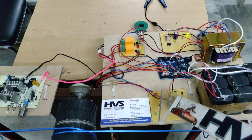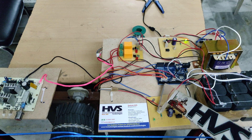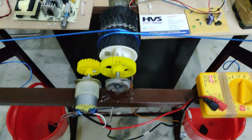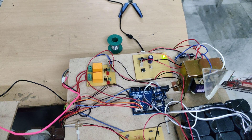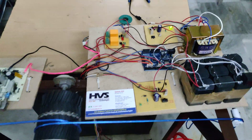Coming to the whole circuitry: we interface the SR04 sensors at pins 2, 3, 4, and 5 of the Uno board. The relay circuits are interfaced at pins 10 and 11. These two relays are used to control the two motors inside the buckets. This is the charging circuitry — from this transformer we are going to charge the battery in the secondary charging section.